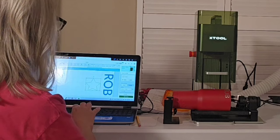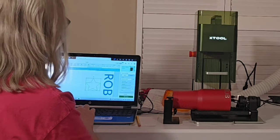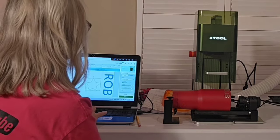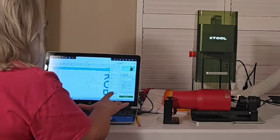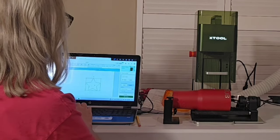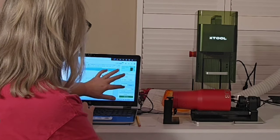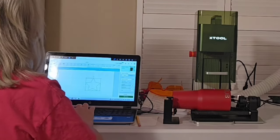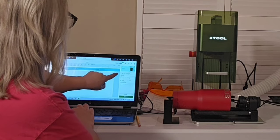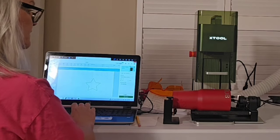We have engrave. Let's check our settings. Change the power to 100, and we'll change the speed to 400. I'm going to get rid of that one. I'm going to be doing this one. Let me click on it again. Object, engrave, manual setting, laser type. Let's go back. Laser cylindrical, auto planing, framing. All right, we'll frame it out.